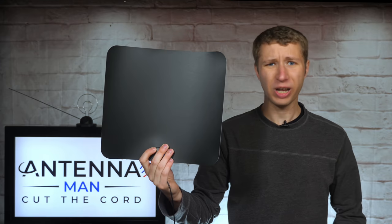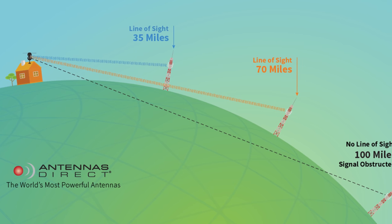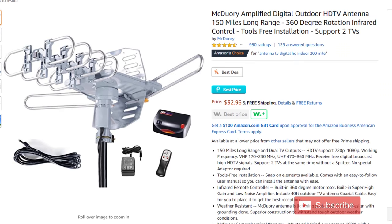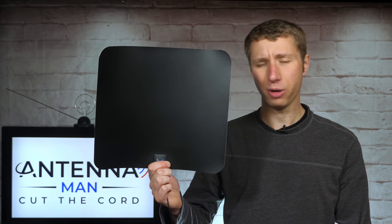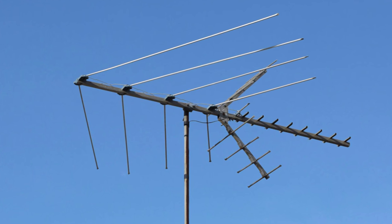The other thing I can't stand about this antenna is the bogus 250-mile range claim. TV signals tend to disappear over the horizon between 70 to 80 miles from the broadcast towers due to the curvature of the Earth, so any antenna that claims beyond a 100-mile range is likely junk. The mileage claims on most antennas are not accurate at all. What matters is how the antenna is designed for certain TV frequencies — VHF and UHF. This antenna is a very basic flat indoor antenna with pretty much no gain, and it's not going to work as well as a larger antenna no matter what the mileage claim is.